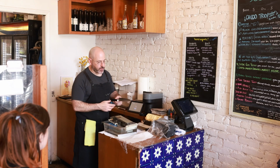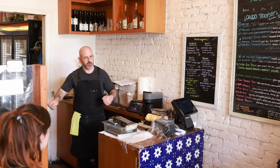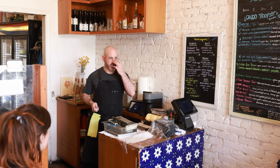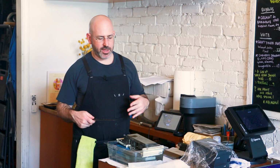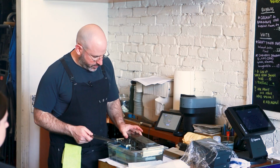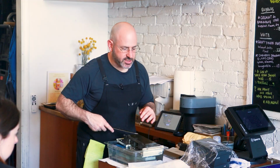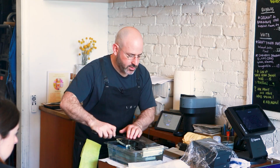And what I like to do for that is a stropping motion. Have you guys ever seen barbers with the straight razors and they have the leather and they do this with it? That motion is called stropping. And stropping is a full-length edge-trailing stroke. So, for example, this is a stropping motion. I'm covering the entire length of the knife, one side, one side, one side, one side. So I'm alternating. And in doing that, the burr gets bent back and forth a whole bunch, and it makes its connection to the edge weaker, and it makes it smaller, so that eventually I can remove it.